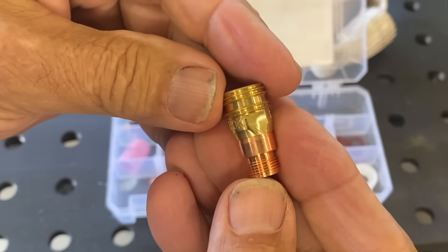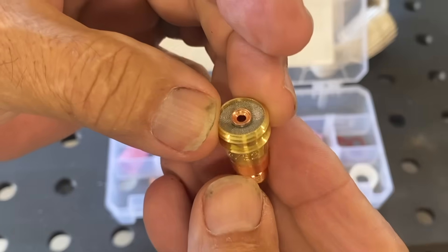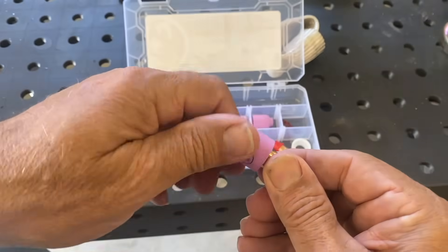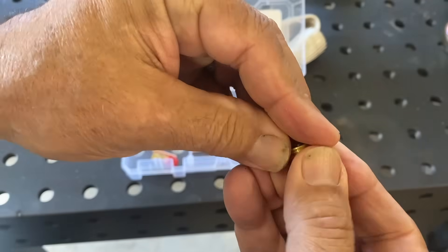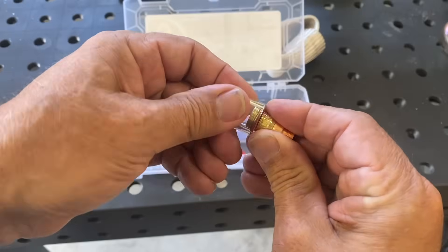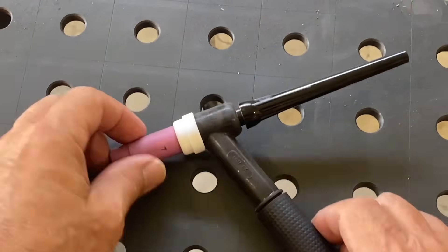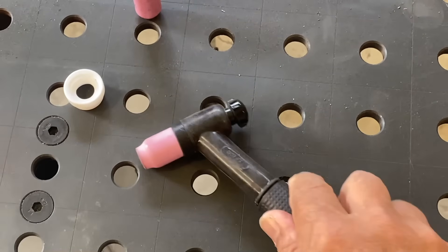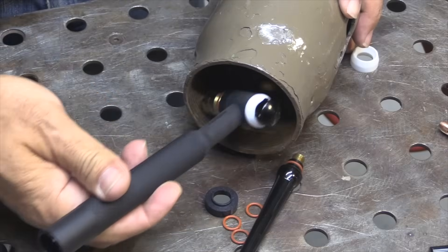Here's why I think ours is the best one out there. The key component in a kit like this is the gas lens. We use made-in-USA Furick gas lenses with an O-ring groove. Without the O-ring they work great with the pink cups, or put an O-ring on and you can use Furick clear cups — very easy to switch back and forth. You can also shrink the size of your 17 style torch down to something more like a 9 or a 20.